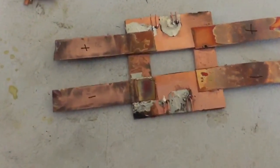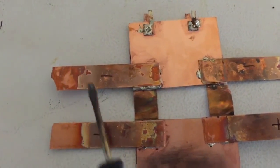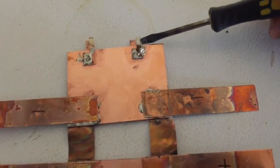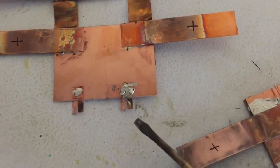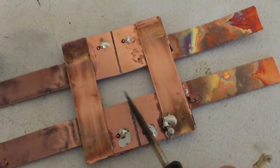Here's the finalized product. There's the one I made earlier, and here's the one I just made in this video. I've marked these copper strips for the correct polarity and put some little terminals on — just soldered these on. These are little strips of copper for your MOSFET or IGBT connections, and you can solder the pins of those directly onto these. I also used little bits of 12-gauge wire for the connections on the other one. If we turn this over, that's where it's divided — where I dremeled it — giving you the correct bridge configuration.